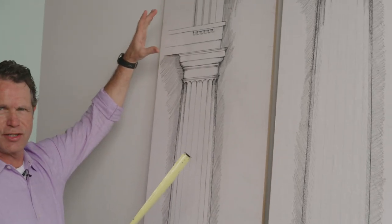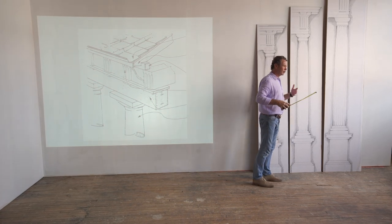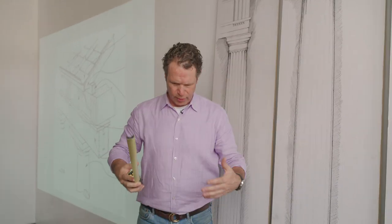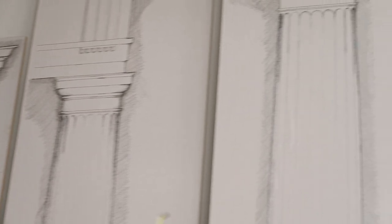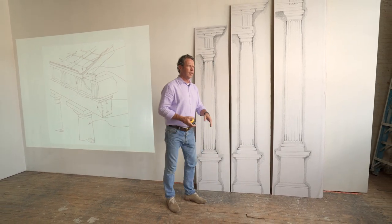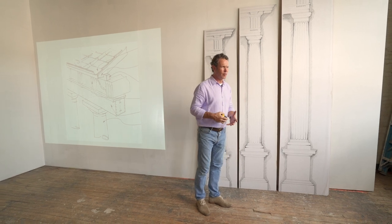The architrave here, which influences the size of our door and window casings — this one is 3-5/8 inches. Same order, we've grown about a foot in height, and this one is 4-3/16, and this one is 4-5/8. Notice, too, the height of the chair rail changes: this one's at 20 inches, this one's at 22, this one at 24 to 25 inches. All the parts and pieces change. Big rooms need bigger moldings, small rooms need smaller moldings.